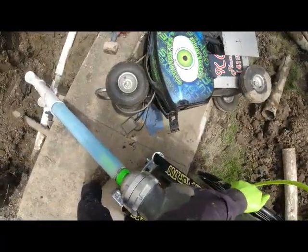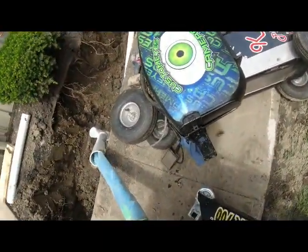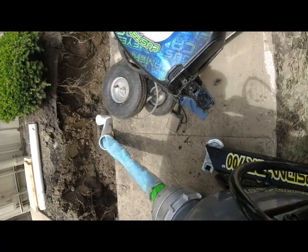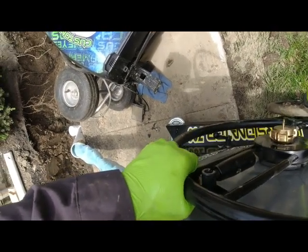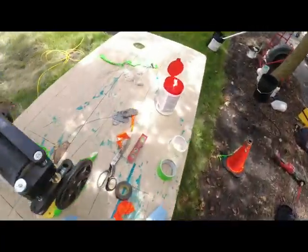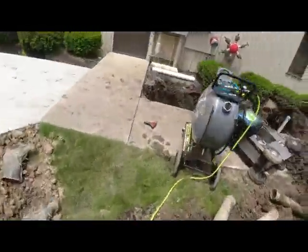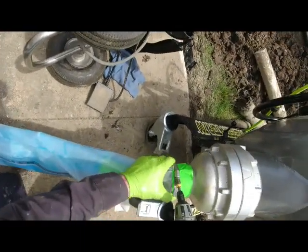Here's an extra step that I don't do anymore — I've figured out how to do it better. That is, taking the tape off the end of the liner as I'm pushing it in, as I'm inflating it. The reason I put tape on in the first place was to hold the epoxy while I was saturating the rest of the liner. But I no longer do that step. Must have got my hands saturated with epoxy, so I grab one of these Hercules wipes to clean it off so I can have some grip on my gloves, because this stuff is so greasy when it's wet.